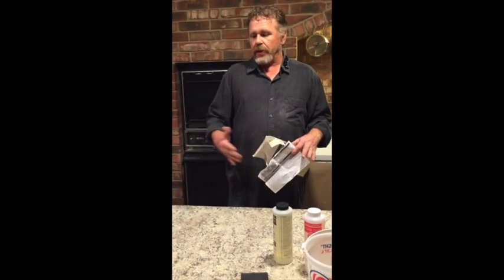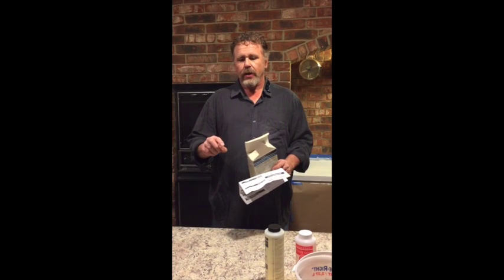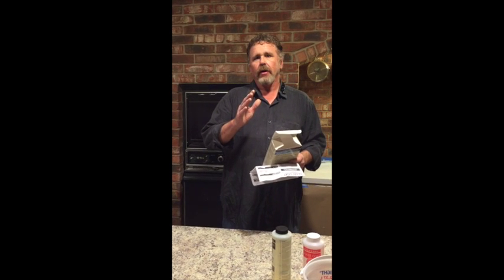After you paint your surface and get it the way you like it, you need to put a clear coat on it. You could use polyurethane, you could use polyacrylic. I would highly suggest getting something called glaze coat. It's an epoxy that self-levels over the surface and creates a nice thick protective surface. You could think about some of the bars you may have been to where they have maybe silver dollars inside of a clear coat on the bar, that's exactly what this stuff is.